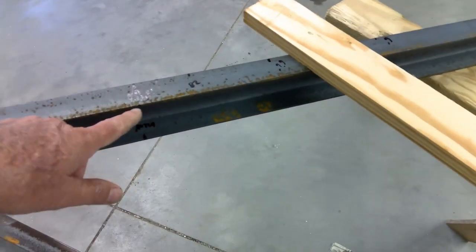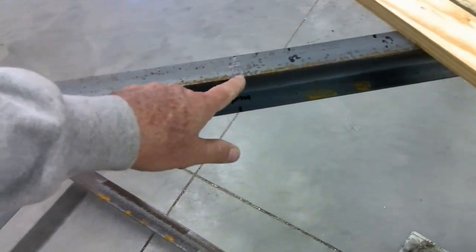If I did my math correctly, I have to take out 5/8 of an inch on my notch. What is that math? Pi times 22 divided by square — no, I don't know. I hold the board up there, take a square off the bit, make my mark where it needs to be, see how many inches that is, and make the notch. Keep it simple. So we're going to notch out the tongue and take all this back apart.